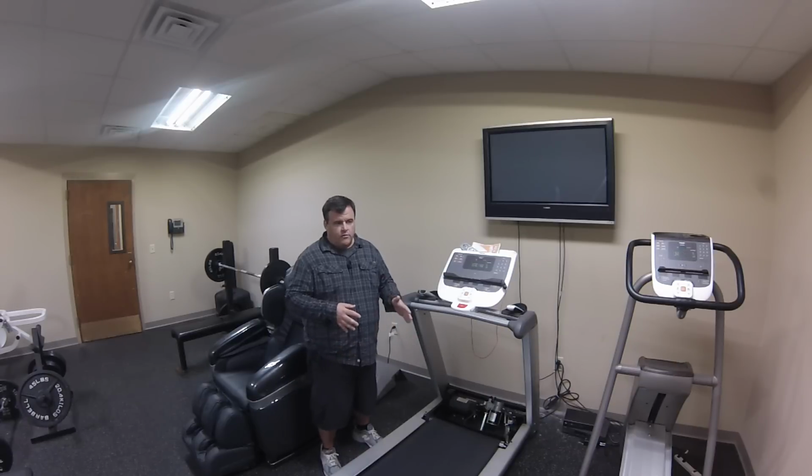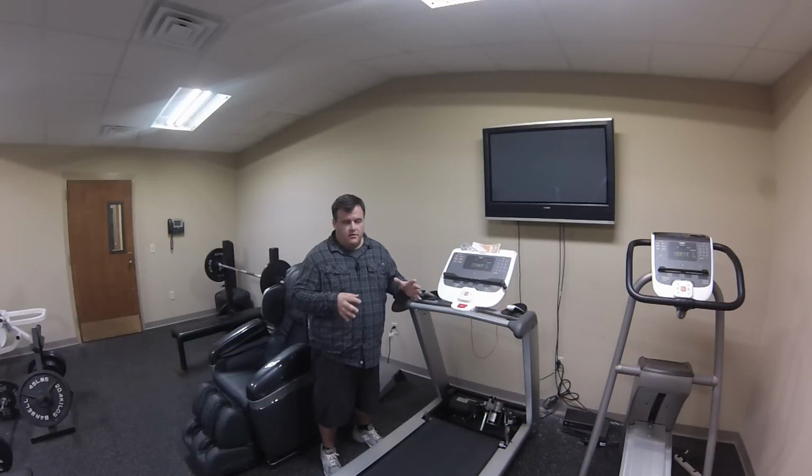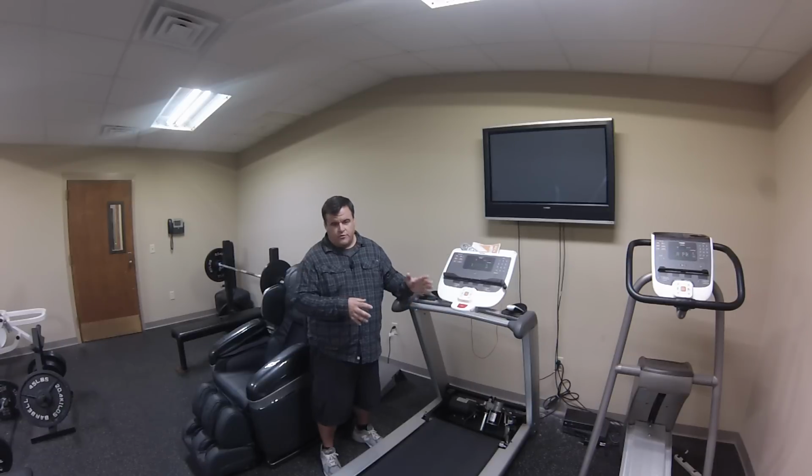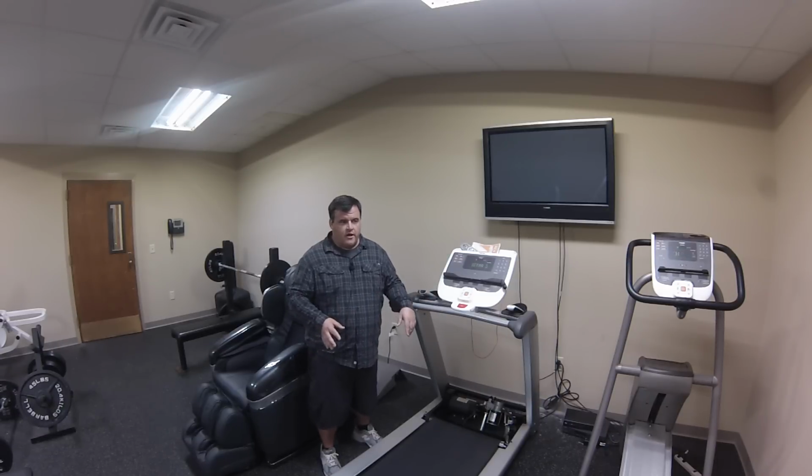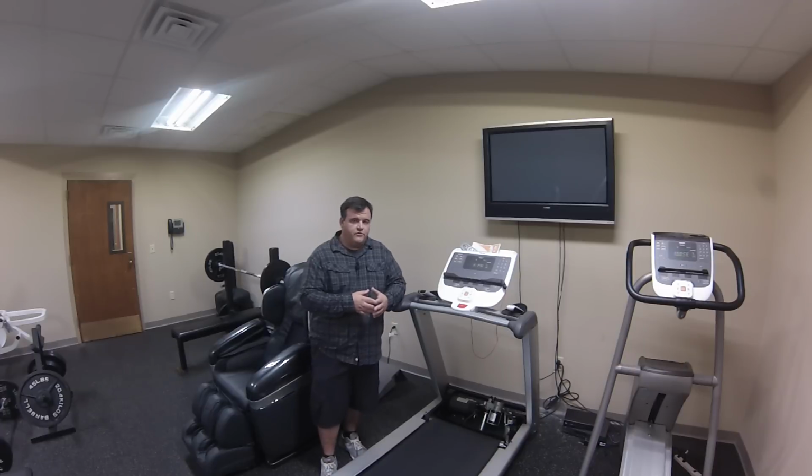So you're walking along or running along, and then suddenly the walking belt stalls for whatever reason. It's losing its ability to push the user down the treadmill deck and keep the user in stride. So immediately this is felt and interpreted by the person using the treadmill as a slip or a skip, because you break stride and it's very disruptive.